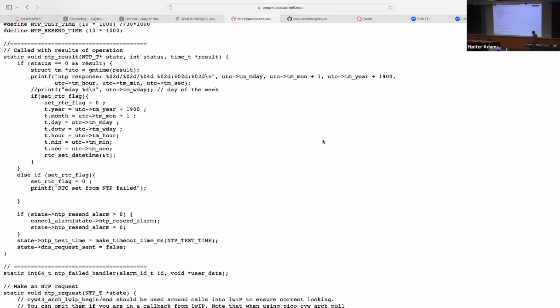Any questions about this? I think this is neat because it's a tremendous capability to be able to actually access the real time from one of these little devices. If you get on the network by way of the procedure that we talked about earlier with the Pico W, then with only UDP communication infrastructure, you can get that time. Handy for watches. Handy also if you are gathering data of any variety, it's probably the case that you want to timestamp the data. And without access to real time, you can, of course, timestamp it with time elapsed since boot up. And perhaps you've written down the time at which you booted the system up. But if your data gathering device has access to a Wi-Fi network, this is an autonomous way by which you can get the real time with which you could timestamp data for scientific or diagnostic purposes.